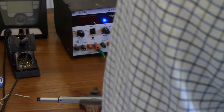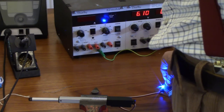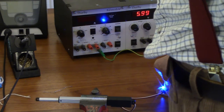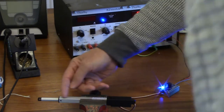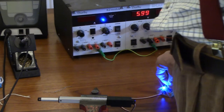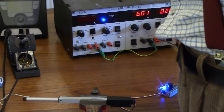So what would that be doing? It's not a stepper motor. No, I think it's an ordinary brushed motor, probably controlled with one of these delightful PID algorithms. No, it knows its position from a potentiometer which it's got in there. Another potentiometer. We don't know where that is. That'd be a sliding one, probably. So some of that fiddling around could be just a bit of sensitivity. It seems to be in an algorithm. It decides to turn itself off after it's decided it no longer needs to move any further. Sometimes it does it immediately. There's a very small change I made. You see, it's going to fiddle for a time and then it stops.